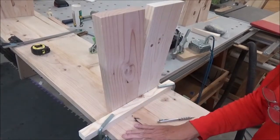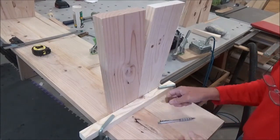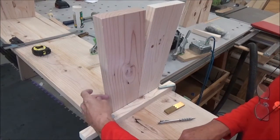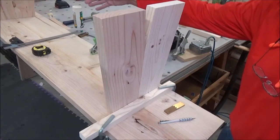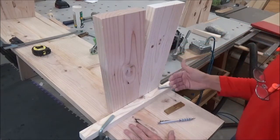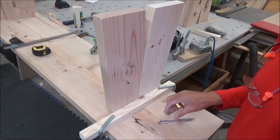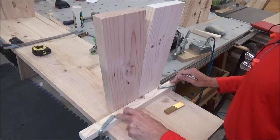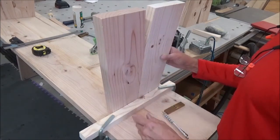I got my benchtops squared up. What I've done here is measured 12 inches in from this end, on center with this leg. The reason for that is I'm allowing two feet for each person to sit. You don't want this leg too far inside, because if somebody sits right on the end, it becomes like a teeter-totter. So at 12 inches I'm good. I've laid a spacer block — a reference block — and made marks where I'm going to put dominoes.